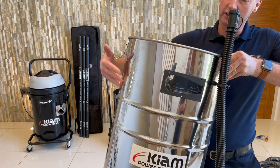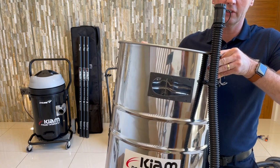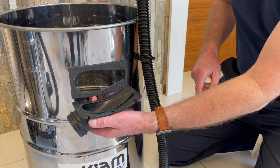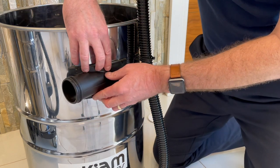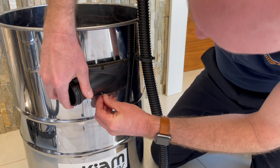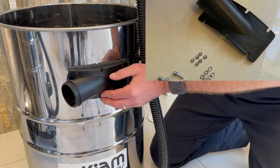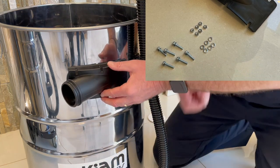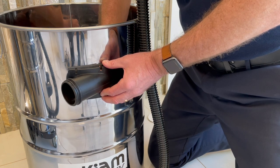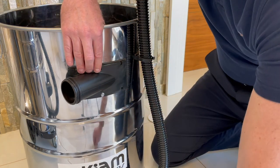What I'll do now is fit the side entry inlet with the screws, nuts and bolts. I'm going to put the face of the inlet to match the gasket — I'll put it up there and put the bottom ones in first because that will hold it in place. Just take the weight, put one on, one on there, then put a washer and a nut on the back, put that on finger tight, and just put the top one in as well just to hold it in place.